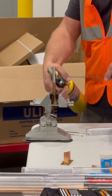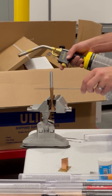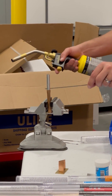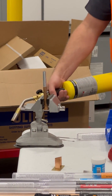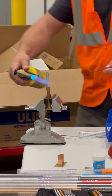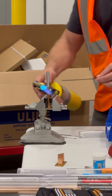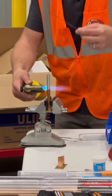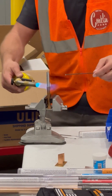All we're gonna do is heat the metals, but we're gonna bring the heat down to the copper because it takes a lot more temperature. At the same time, aluminum will melt at what temperature? 1200 degrees. We're just gonna start heating up the aluminum and then move down to the copper, and by heating the copper it'll draw the material down into the joint, which is also very important.